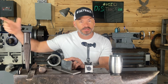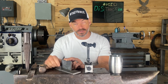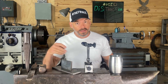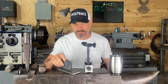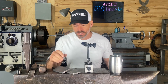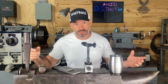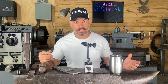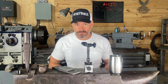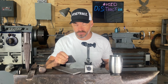I welded something the other day that had paint all over it. I knew it was going to have porosity, and it did, but there wasn't anything I could do — I couldn't get a grinder in there and didn't have time to run a 6010 first. It had a little porosity but it didn't matter; it was just holding a motor down. If somebody wants something done right now, you just do what you can. Now if it's pipe, that's a different story — structural is generally considered junk iron if it's not round.